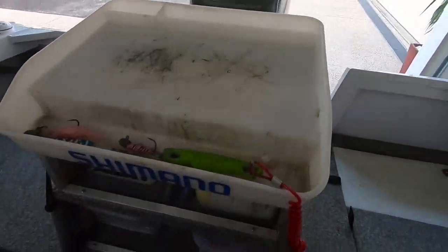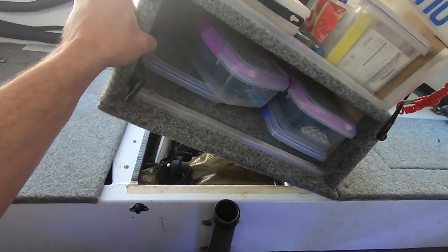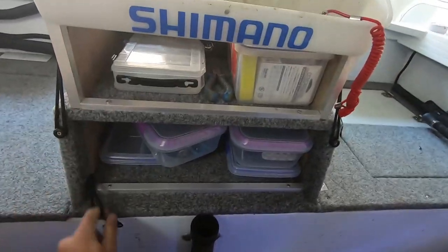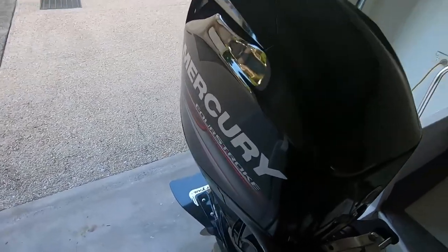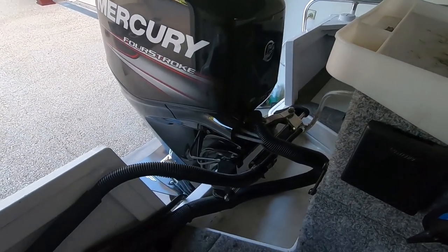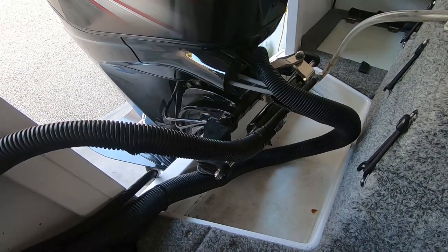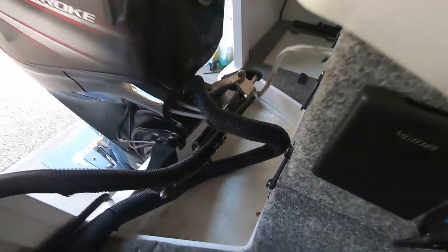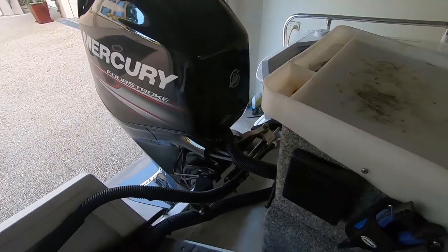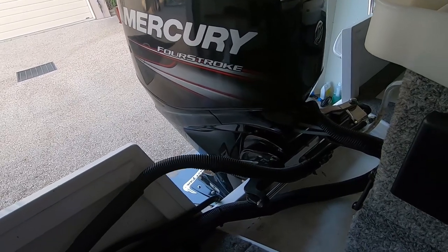There are cup holders on the side of the bait board. That whole bait board still hinges off the original lift-up compartment that came with the boat — I can still get under there and I have some storage there. The biggest and most recent change is the hydraulic steering upgrade. After 500 hours and three years, the cable steering started to play up, so I went straight for the hydraulic. Oh my god, it's a new world. I installed it myself — it wasn't that hard, just needed a few tools. I know how it all works and can fix it if needed.